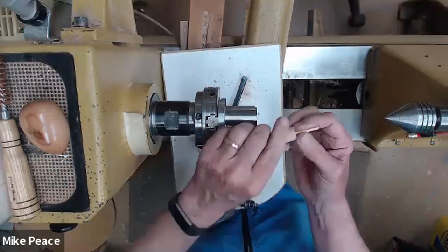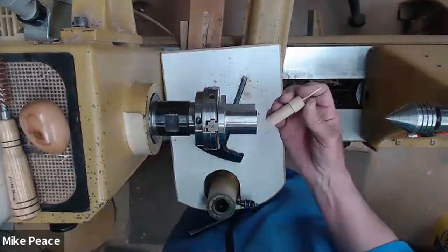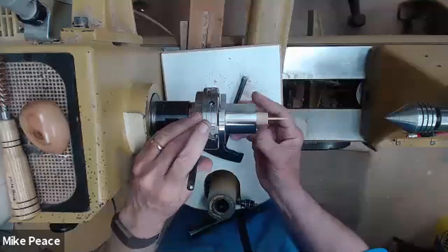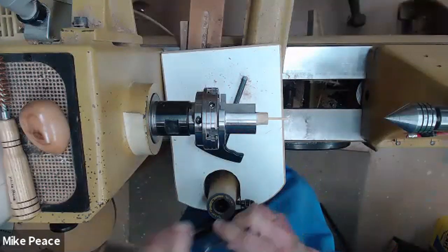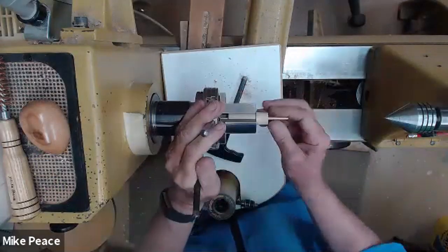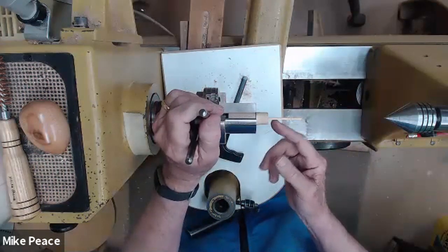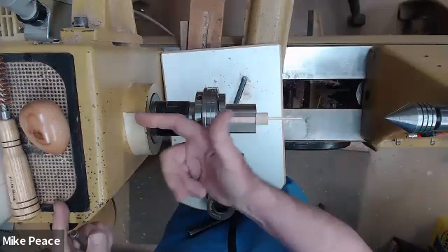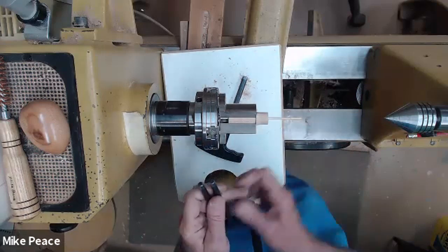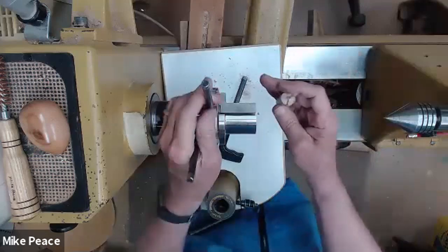But basically, you make a little collet chuck, and you're using bamboo skewers that might be 12, 15 inches long. And you've got this very simple collet. The trick is you have the bamboo skewer that's very, very small. It goes all the way back down into your spindle. And you turn off a perch, loosen it up, pull it out a little bit more to the next one, tighten it up, turn off the next perch. You can put a little knob on it, you can turn it down, but you can see how this concept works: you can take a long rod that's no more than about half an inch or so, through the inside of your spindle, and you could just keep doing something. So that's an example of a production way of doing it.